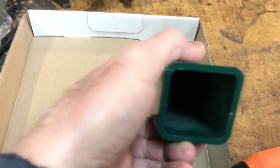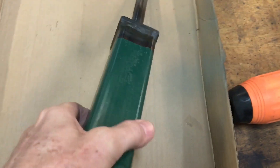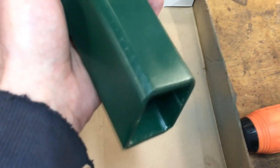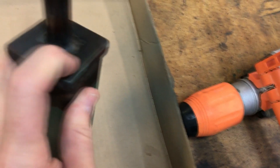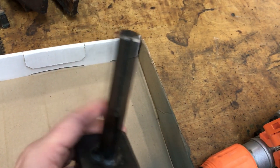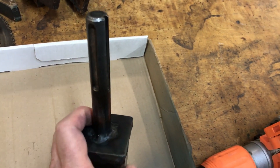This is two-inch steel — you can see it's roughly a quarter-inch wall thickness. Didn't need to be that thick, but that's just what I had. You could use circular stock, or whatever you want. In the back I've got a piece of three-eighths-inch steel. It happens to have an angle on it just because the original piece had that angle, and I thought that might actually help getting it over the post. The cap is three-eighths-inch steel, welded on, and then the bit — which goes into the demolition hammer — has also been welded in. It came off at a little bit of an angle, but we're not going to worry about that.